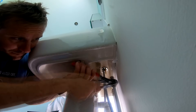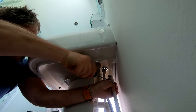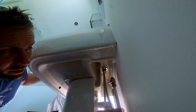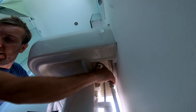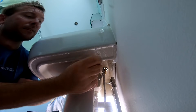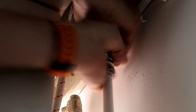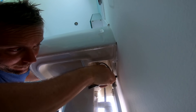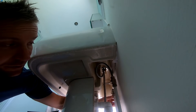Just want to reiterate this point to plumbers, apprentices, and DIYers: if you find that the valve you're trying to work on doesn't work, replace the valve, please. And what they've done with these - there's a trick to this, because these are quite long. You wouldn't want to kink these up when you're getting them in. So what you do, you loop them around over the top, just like that. Also make sure that the rubbers are in the ends before you do that as well. And remember what I said about these - they don't need a lot of tightening up, just a little nip. And we're there - I'll just do the same on the other side now.